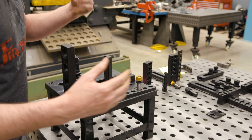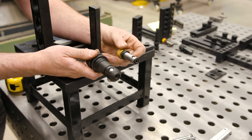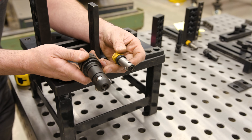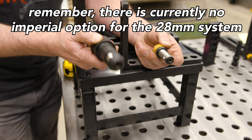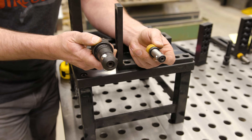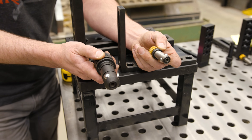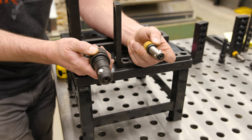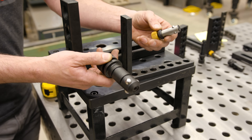For me, I didn't know which one to choose — the 5/8 table system or the 28 millimeter hole system. I was really conflicted because they both do different things. This one can't get precision because of its grid pattern, and this one's just too light duty — the fixtures like to bend. So I thought there should be something in between, something that could do the best of both. And that's where I came up with the 3/4.